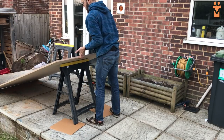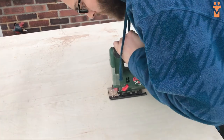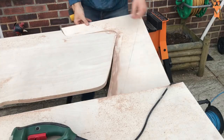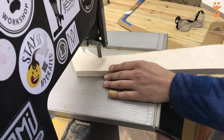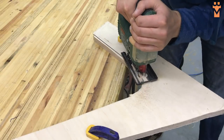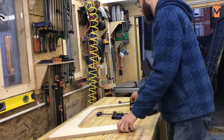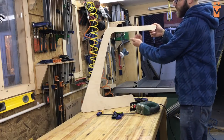As you've probably seen in the video thumbnail, our submission for the plywood challenge is going to be an end grain side table. I made a really quick card template which I used to draw around onto the plywood. I'm going to be stacking a load of plywood layers together and using a router to perfectly copy every layer, so it's really important that the first one is right. I used the bandsaw, tablesaw and jigsaw to get close to the line and then refined the shape with lots and lots of sanding.